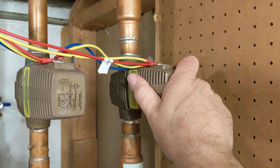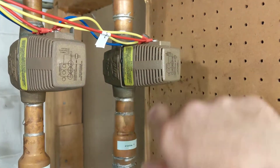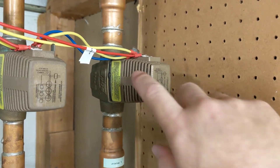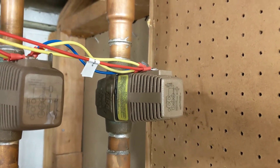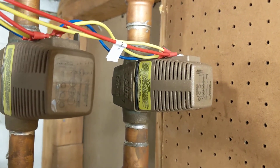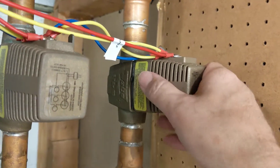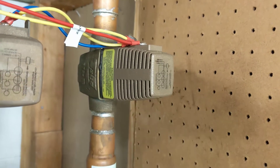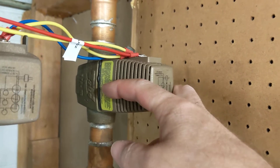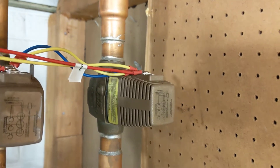One of the main points is there's a heater element in here — you can usually feel these things getting hot. You can't just turn off the switch and pop this thing off. There's a mechanical system in here: a heater wrapped around a grease-filled piston. As the heater heats the grease, it extends the piston; when the heater turns off, the grease cools and the piston retracts. So you're supposed to wait a couple of minutes for the whole thing to cool off to be sure the system is in a neutral position before you pop it off.